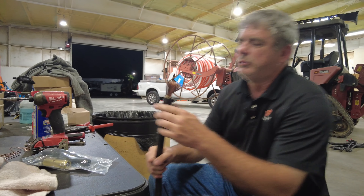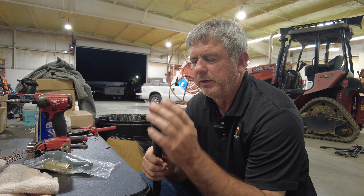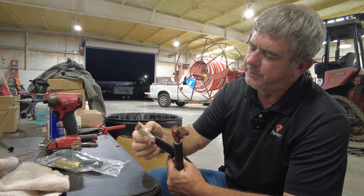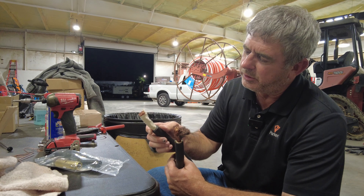So what we're going to do is put an end on this cable. When you take the cable off, you see how the wires get all messed up — and in a minute you'll see why that's a problem. You guys working in this environment should see how I put a piece of tape on the end: this protects the wires, you can use it over and over, continue to land the cable on a lug, and the wires all stay intact. If you want to connectorize it again, all the wires are still trained and it'll work out nicely. Pro tip: make a little flag on the end of your tape so the person removing it can find the end easily and pull it off.